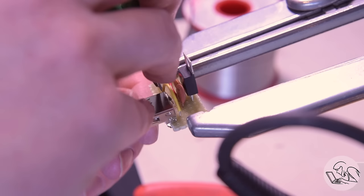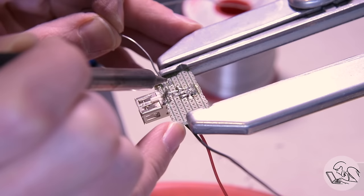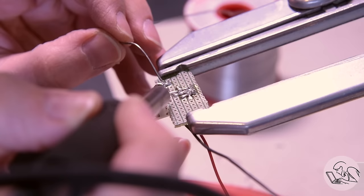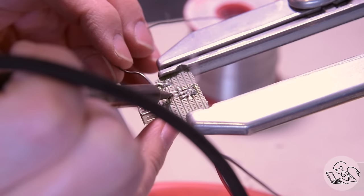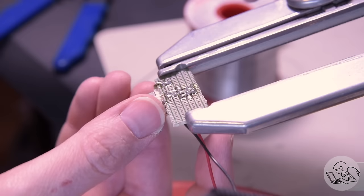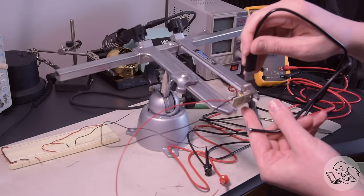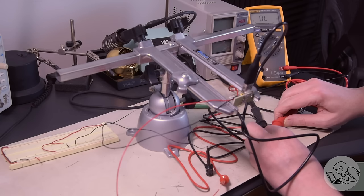The secret — and this is not a well known feature of USB — is to short the data pins together. That's actually part of the USB standard. If the data pins are shorted to each other, then any USB device plugged into that port will understand this is a charging-only port and will treat it as a dumb power supply that can supply 500 milliamps. It will not attempt any negotiation or data exchange. So just short the data pins together and you've got a universal, fairly low power source that works all the way up to modern USB-C. The downside is 500 milliamps on modern smartphones is really not very much — it'll read as slow charging mode, basically the USB 1.0 charging limit. But for how easy it is to build, still pretty handy.